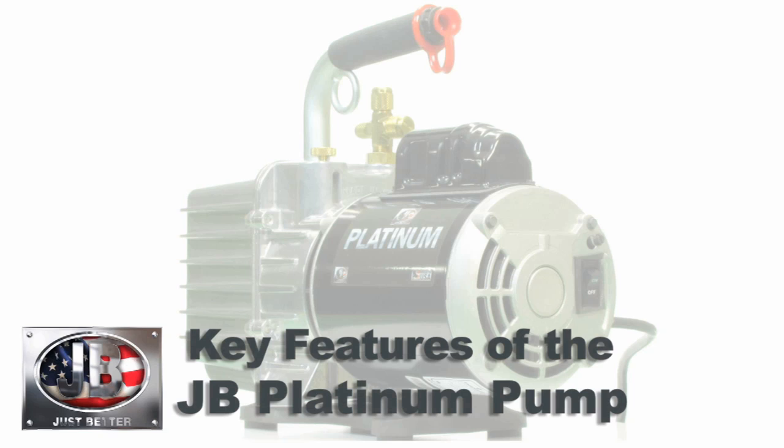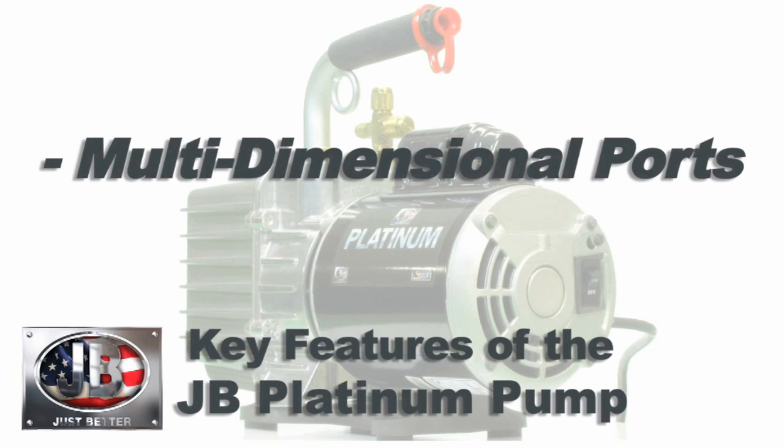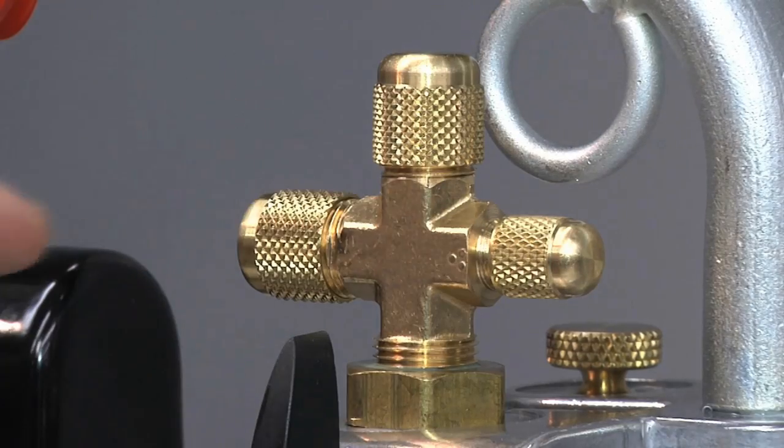Another important feature of a Platinum pump are multi-dimensional ports on the intake. We have 1/4 inch, 3/8, and 1/2 inch intake ports. So you can connect to any manifold or system that you want without having to use adapters.